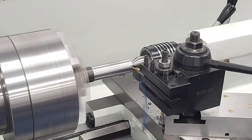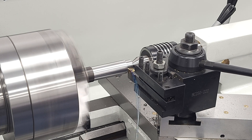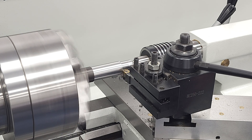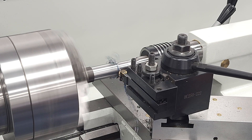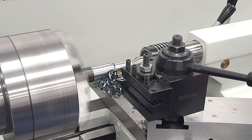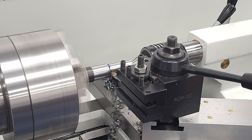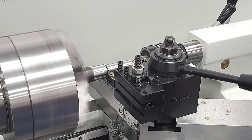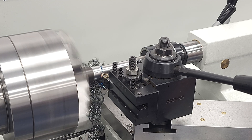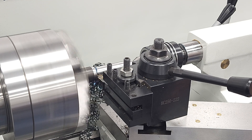That light pass obviously isn't going to be a problem, so we'll just crank up the cutting depth until we have trouble. This is a 70 thou pass and while it cut nicely, it didn't want to break off a chip, so we got a bit of a bird's nest. 4140 can be stringy so I'm not surprised. I do like the blue color of the chip so I think we're at the right spindle speed, but I'm going to crank the feed a little to see if we can get the chip to break. I wanted to include this shot because too many machining channels only show the wins — that gives a false sense of how easy machining with an untested material and tool combination is. No matter what, there's going to be experimentation before you find what works.